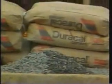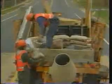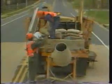For the concrete, use a high early strength cement. If not available, use other approved cement. You will also need clean aggregate with angular stones no larger than two centimeters, clean sand and water, and a curing compound or fabric material to cure the concrete patch.